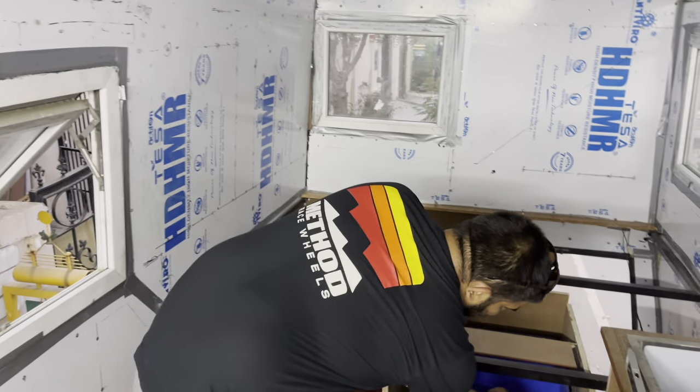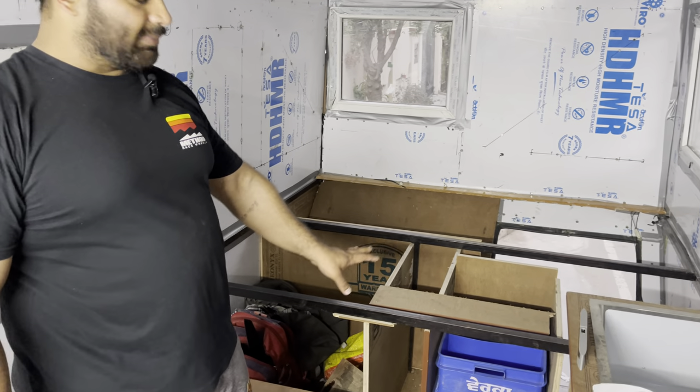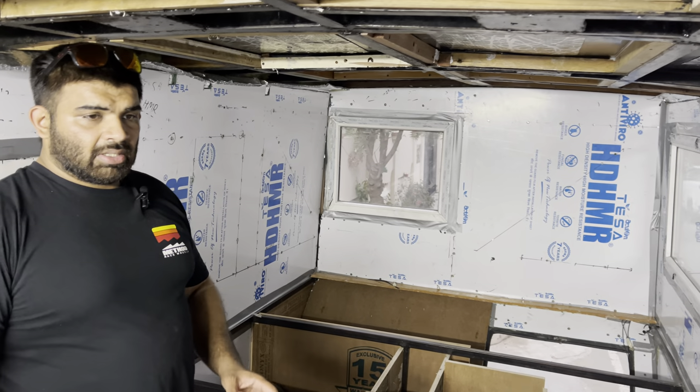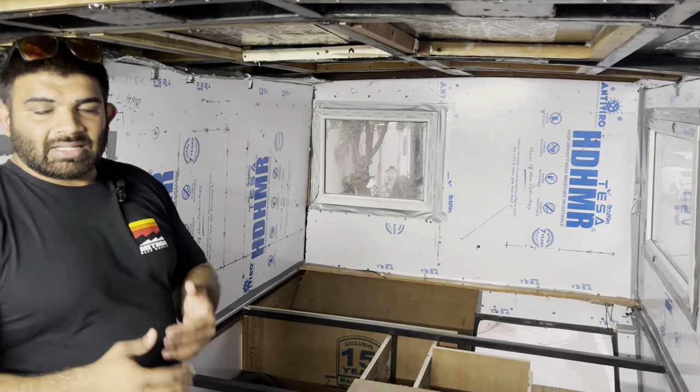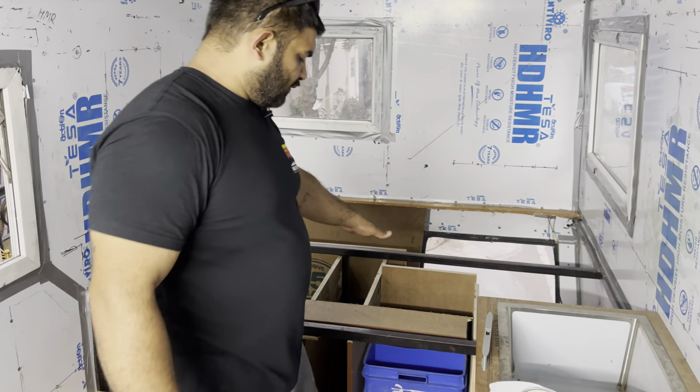When designing the camper, we have to keep in mind that the entire house is going to be moving — create space like that and the minute you brake, things will pop out and fly off. So every drawer and every shelf will have a small strip of wood in front as a positive stop — it won't let it roll out with braking. All you have to do is lift, slide, and roll it back in. We're not using a lot of movable parts and parts that tend to fail.